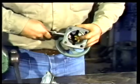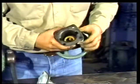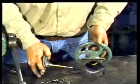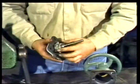Next, loosen the finger plate and take it off. The inside of the bonnet can be checked for signs of corrosion and wear. Unscrew the stem from the diaphragm and separate the diaphragm and backing plate.